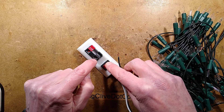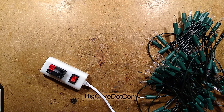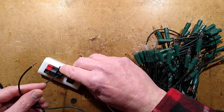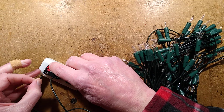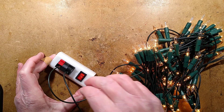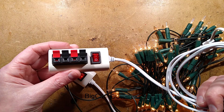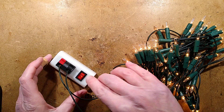The live is the black connection and neutral is the red connection — that doesn't work in many other countries which have red live and black neutral. If I stick my fairy lights into this now — and I really don't recommend using these things — I just find them quite amusing because they basically show how electrical standards differ between countries. It means you can now test your fairy lights just by stuffing them in here. And if you want to connect more, you go for the luxury version, which has a double speaker terminal so you can connect two circuits or more.